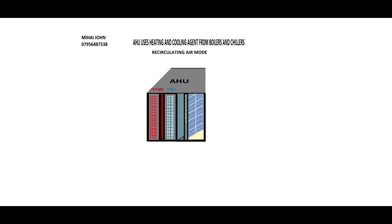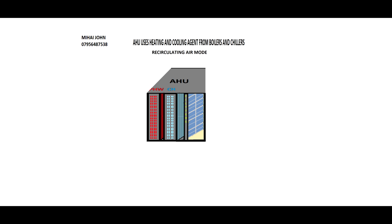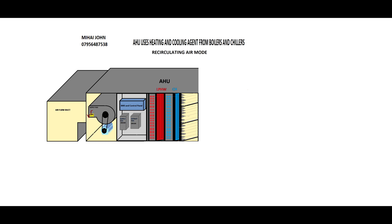You will join the control box to the rest of the air handling unit. Like any other AHU, you need to cool and to heat the air, so you will design the cooling heat exchanger, the heating heat exchanger, and the filters — they come all in a block. Once finished, you connect it to the AHU, and now your AHU starts to look more and more like a proper air handling unit.